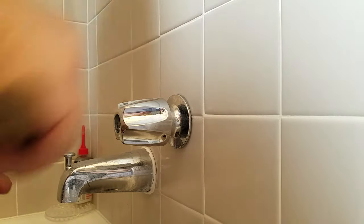Put the screw back in. Okay, that's the cold side — pretty much good to go. When you reassemble, you don't need to get crazy. Sometimes this screw gets loose just from use, and these handles start getting loose and jiggly. You can go buy a new handle and put that on, as it's usually the handle or decorative side that really rots out first. Depending on how old your faucet is, sometimes you can just replace that whole shaft piece.